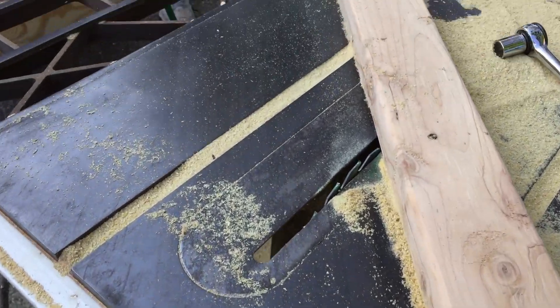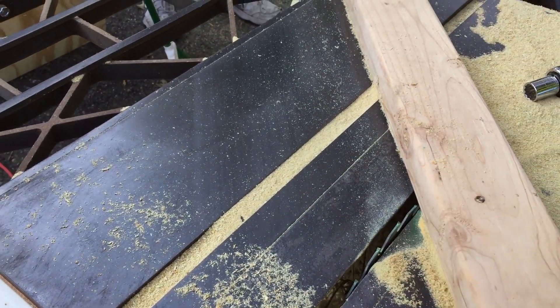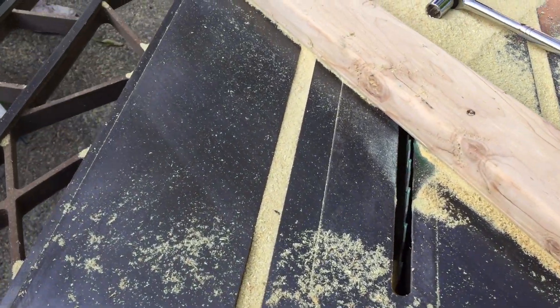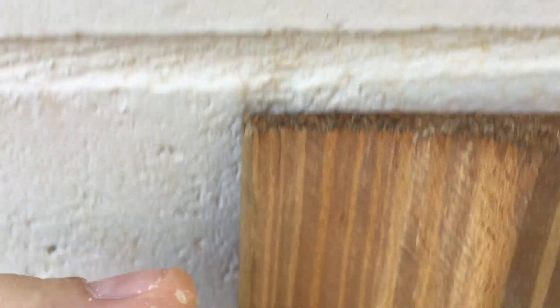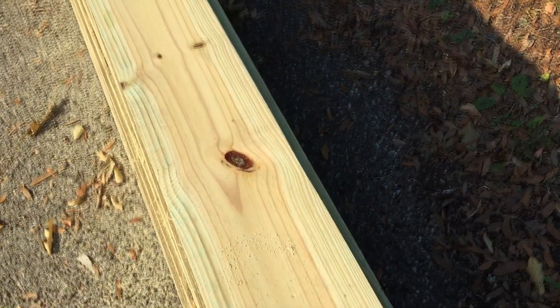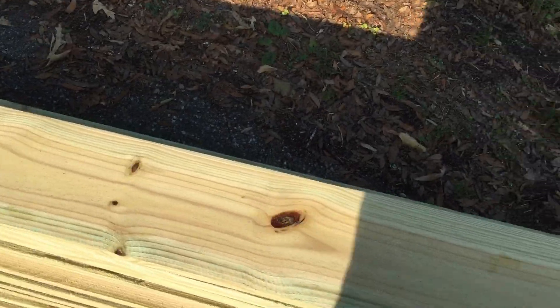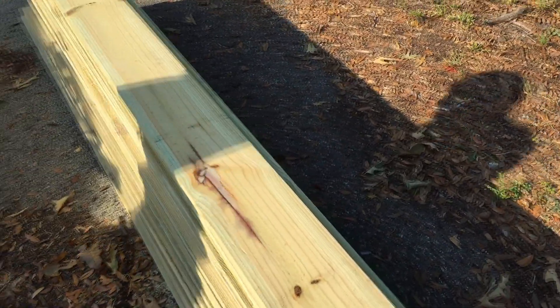We've run some test pieces through here. What we started out with was putting a fence on here at 45 degrees to the blade and getting the blade down real low. You'll have to raise it up about an eighth of an inch on each pass until you get the thickness off that you want. This is the profile we're actually going to cut — we're going to cut this round cove part in here and then grab this edge so that it overlaps. We'll do all that on the table saw. Here's our stack of 1x8s ready to run through. It's just flat across the surface — typical 1x8 from Home Depot, 12 foot long and pressure treated, so it'll last a whole lot longer than the stuff originally on the house.